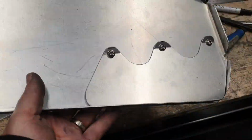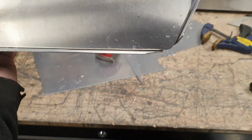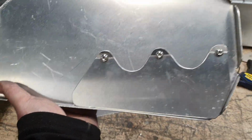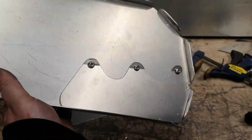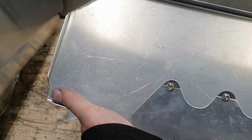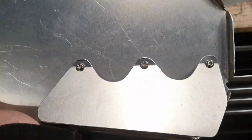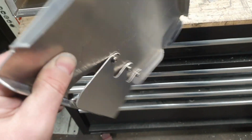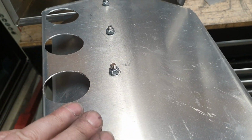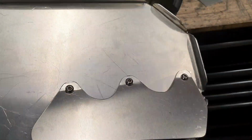And this is my valve that I was talking about. Pretty good, eh? So this goes inside and it goes this way. So if the fluid tries to go from where we are to the other side of that baffle, good luck with that. There will be some little nooks and crannies that it can go around, like a notch at the end there, which is to give us clearance from that fold. So yeah, that'll work. You wouldn't do that in a factory car because it'll be noisy, right? And long term, that's going to wear and might possibly stop working eventually when it wears.